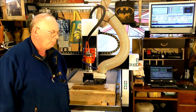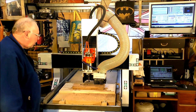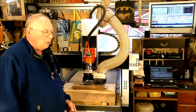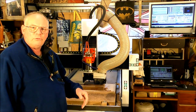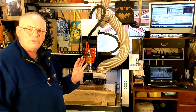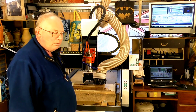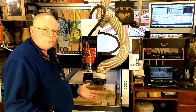Hello there, I'm back. Believe it or not, this is two hours later from when I was last on camera. Because I started to machine this piece and four times the machine has gone into emergency mode. I've had an emergency message come up in Mach 3 saying 'lost communication with external device.' I've been doing quite a bit of fault-finding — nothing wrong with the USB cable, nothing wrong with the Mach 3 card that I can see, but still this message comes up after a few minutes of runtime.